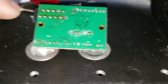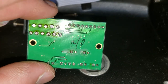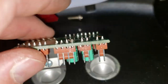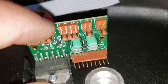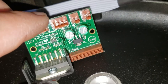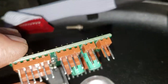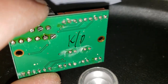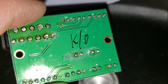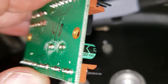Up here is the drive chip. Those two pins are the two capacitors. Now, normally a failing capacitor shows a balloon on the top — there's no evidence of that. I wouldn't expect it to blow through the board, but certainly a bad capacitor could kill this thing too.